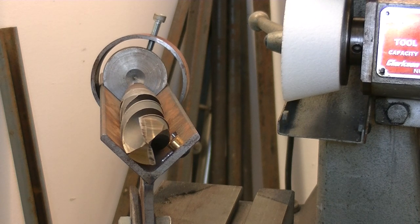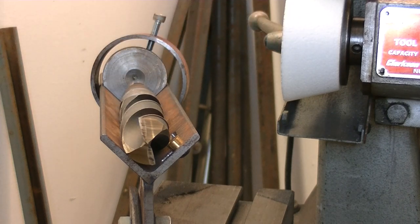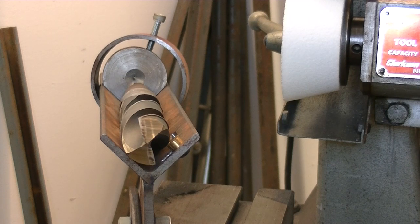I'll send the link in the comments to a video where Graham managed to find the original German brochure for the drill grinder I put up last week — the German brochure was very good and gives a much better detailed look at the facets of it. But there we are — we actually used the attachment. I think 80% success; it works reasonably well. With the pivot point so close to the front of the drill, there's not a lot of chatter there and you don't change the height as much when you change the angle of the drill. However, the setup is a little bit light and dodgy. I also changed out that horrible hard wheel — the new Norton wheel has the inside of the wheel dressed at about 30 degrees, and the actual grinding surface is only about 4 millimetres wide. That's a little bit of a secret: keep the grinding face very narrow to reduce the number of points creating pushback force against your grinding work. Okay, if you think it's good, please like and subscribe.